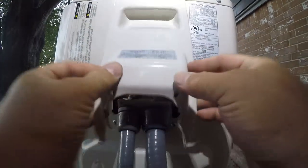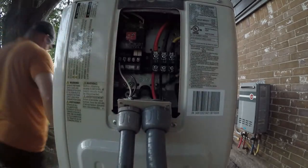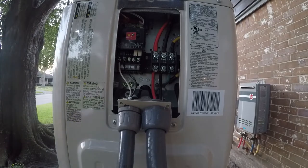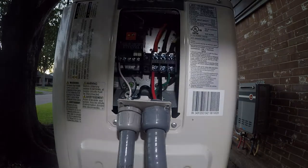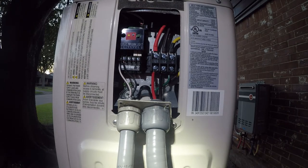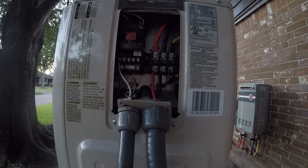All right, let's check this circuit dip switch. So everything is off on the dip switch, and that means we're indoor throttling, 485 communication scheme between indoor and outdoor, and cooling, heating, target pressure, compensation value is invalid. Okay, I don't know what the hell that means. I still don't know where I lost a screw.